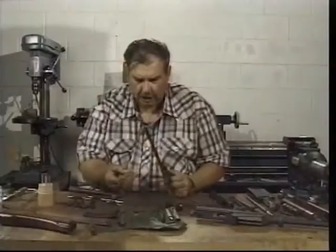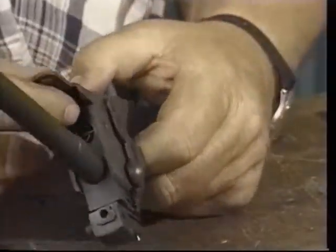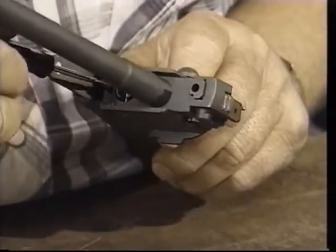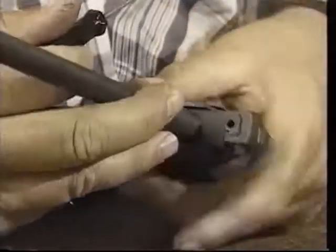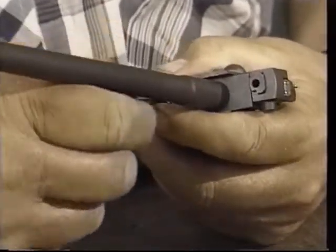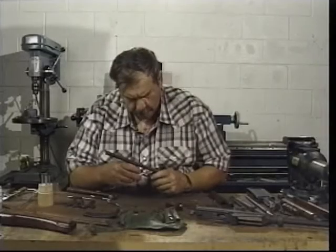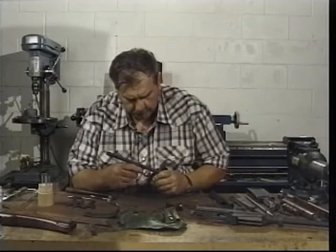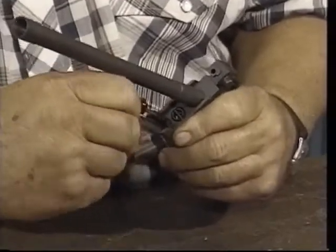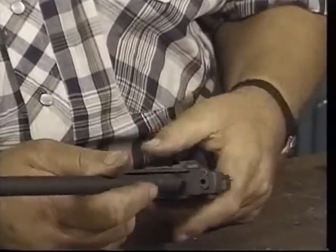Okay, then we can take our lock, which we had before, goes in the screw hole. Now this is what actually retains the latch on the outside. We're going to screw that in. When you're putting the final tension on the screw, it does not have to be anything more than just snug. You can run it up so it's snug. Now our latch is complete and assembled.